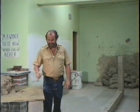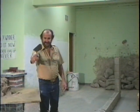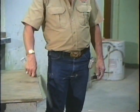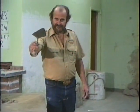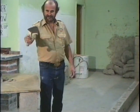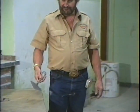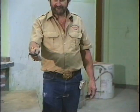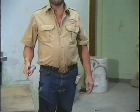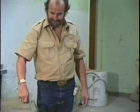We're holding the trowel in neutral position. Turn it upside down. Slow motion, bring it down at an angle. Upside down, bring it down at an angle. Upside down, keeping my arm nice and straight, down at an angle. Do not turn it halfway and have to bring your elbow clear up like this to spread mud for block. Turn it upside down, bring it down.